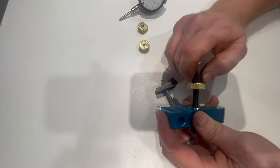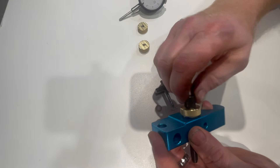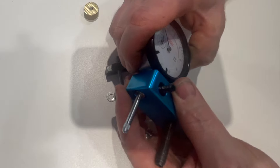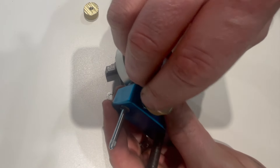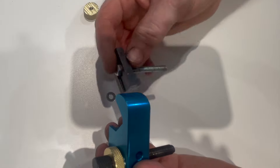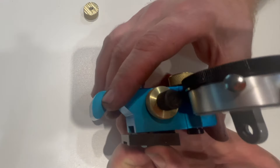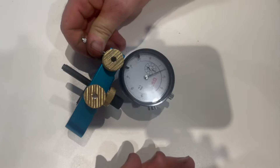I found that once all the toxic stuff is done I just bring this into the house — it's so much easier with multiple cooking surfaces and running water. Five minutes was approximately the right amount of time for the blueness I wanted. I have the black on the left; I just leave that in for a long time because black is black no matter what. I wanted to show this process of assembly. I just used a long enough M6 bolt — I already had it and didn't want to make one unnecessarily. As you can see, it slides back and forth. I used some washers to keep the knobs from chafing the blued surface.